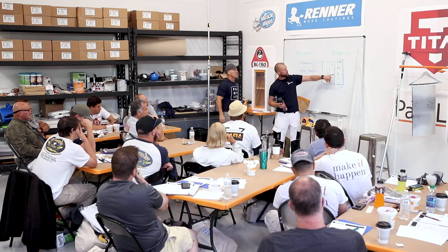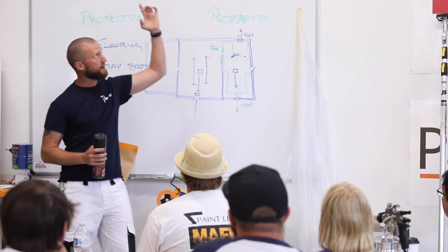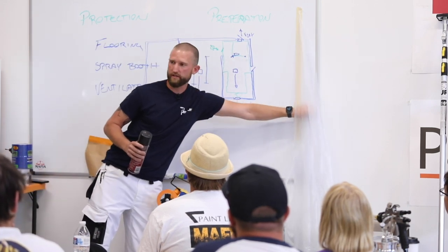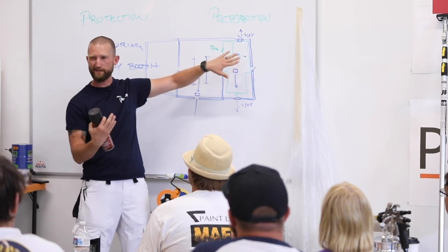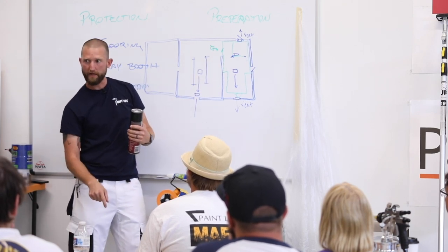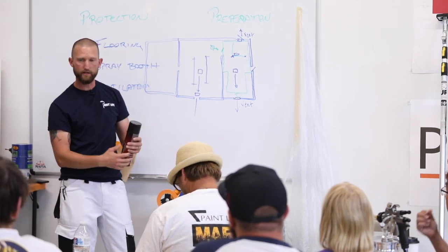Typically, what we're going to do is take this double-sided tape and run it right at the ceiling line going around these walls, so we can tack the plastic down and pull it down tight so the walls are completely covered — no dust. We have a lot of orange-peel texture here, and I want the dust sitting on top of the texture. Then we'll seal that down to the floor paper, because the floor paper was done first and I want that plastic making a good seal.